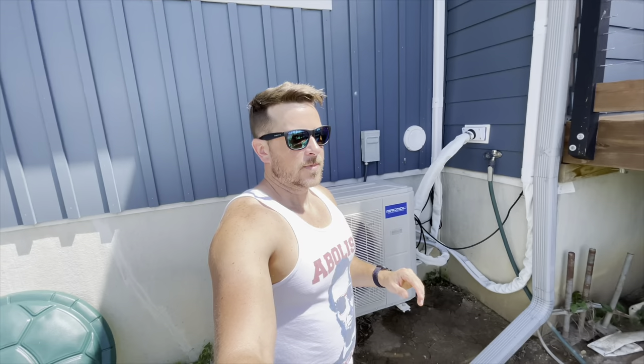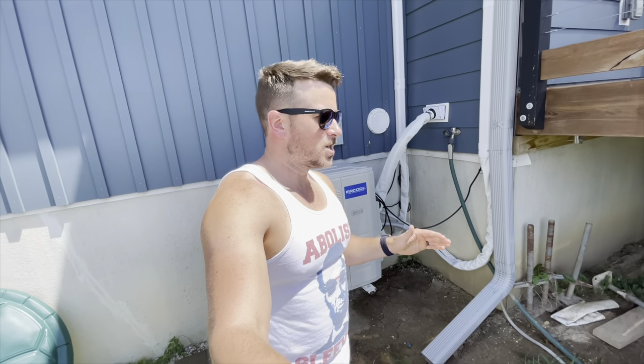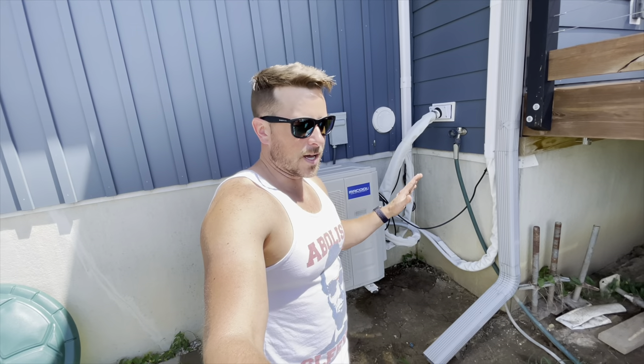These are actually heating and cooling my home — not a shop, not a garage, anything like that. And while I don't necessarily need that much BTU power for cooling and dehumidifying, I may need that much for heating in the wintertime because it gets pretty cold around here. When temperatures drop, while this is a 36,000 BTU unit, it's not actually able to produce that much heat at low temperatures — the BTU output diminishes the colder it gets. While these say they can still heat down to negative 13 degrees, you're definitely not going to be getting anywhere close to 36,000 BTUs at that point. So with two of these, I'm hoping I'll have plenty of heating capacity. I will definitely be updating when that time comes.